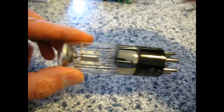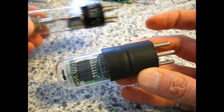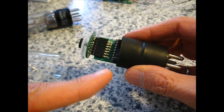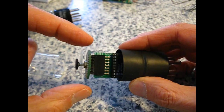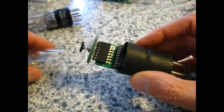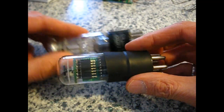The replacement looks something like this. It's actually made out of a 6U5 tube that I have cut open and replaced the guts with a circuit board containing the electronics, an LED array, a plastic diffuser which smooths out the light from discrete pixels in the LED array — and the whole thing fits nicely into the original socket, into the original space.